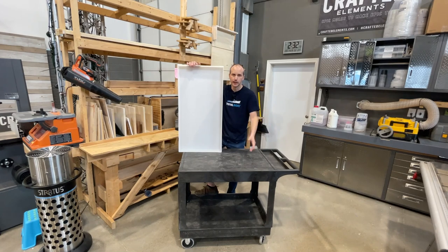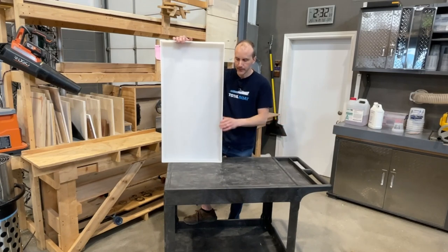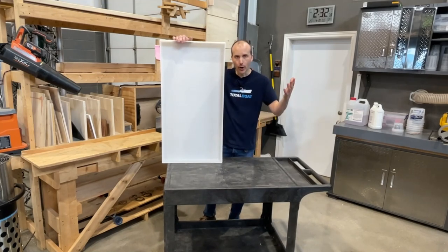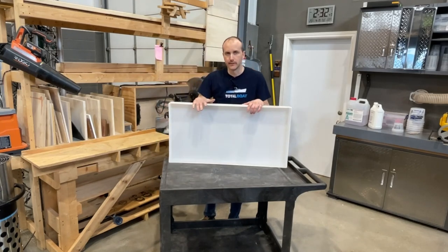Silicone molds have a limited life. If you're using the proper mold release spray, you should be able to get 20 to 30 uses out of a good silicone mold. You should be able to get more out of this HDPE mold, but basically because it's quite a bit cheaper, your cost per pour — and what you have to pass on to customers if you're doing this as a business — is less when using a mold like this. But they also have some disadvantages.